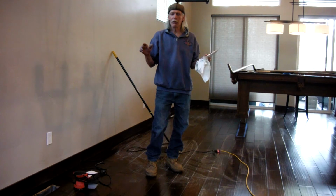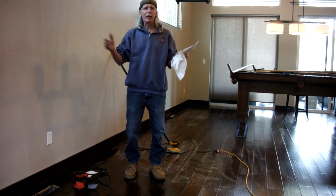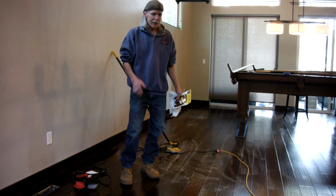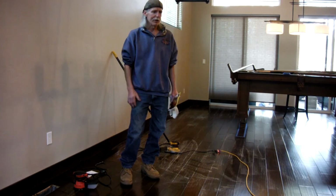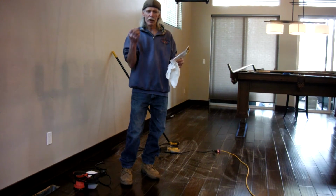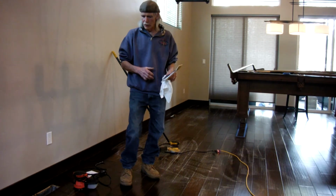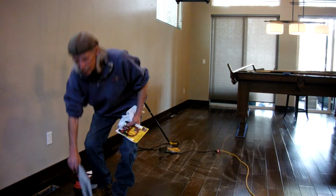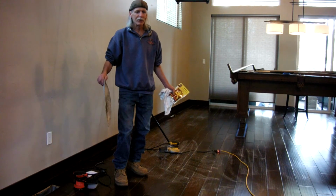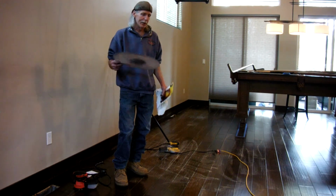First thing you do with any wood floor when you're recoating it is screening. You rough it up. The screening will clean it up, get rid of any small paint specks or, say, pop stains or coffee stains or whatever. But more importantly, it allows the next coat to adhere. It roughs the surface up, so it gives something for the next surface to grab onto. Typically, you would use a sanding screen on a buffer, very like 120, 150 grit, or sometimes even a maroon or Teflon pad.